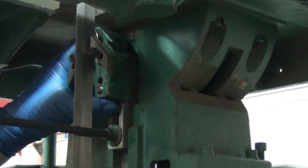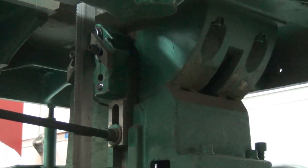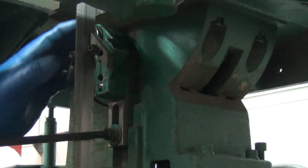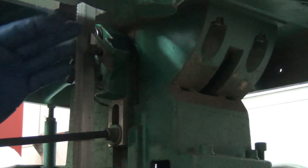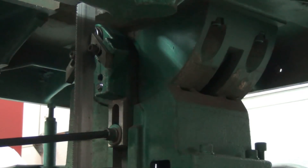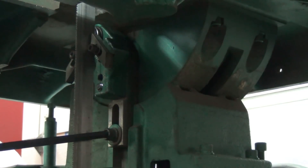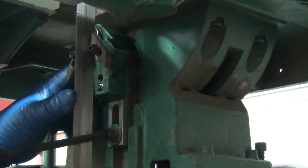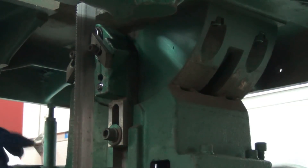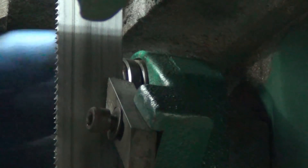The vast majority of my cutting is going to be with the table at 90 degrees, so I'll keep that pushed up. I'm pretty sure that when I turn the table on the trunnion I'll need to lower that down. I don't have any plans of cutting at an angle yet, but chamfering for welding might just be the ticket with this machine. Now that I've got this squared away it should be a piece of cake. You can see there's a gap back there.